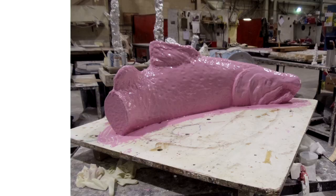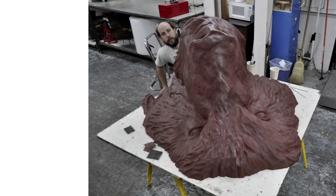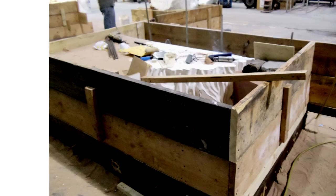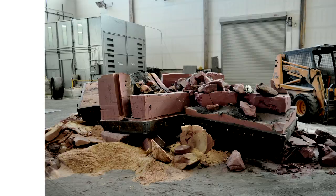In this process, the pieces are formed out of wax with all their finish and detail, and then dipped in a ceramic slurry over and over again over a fairly long period of time, building up a thick ceramic shell. Then the metal is heated up and poured into the ceramic shell, leaving only the metal.